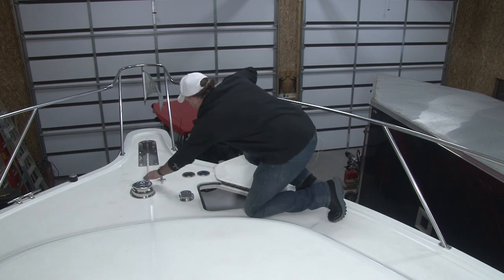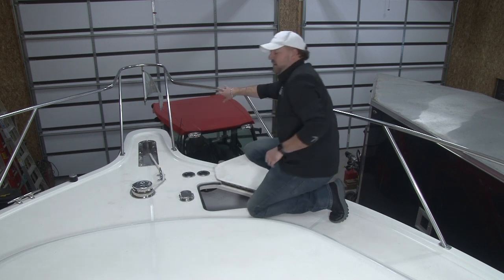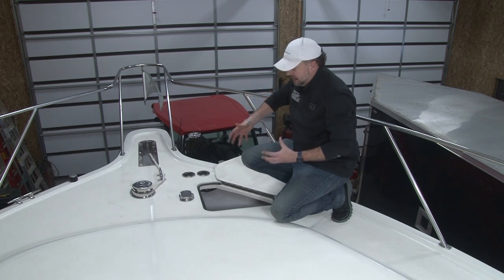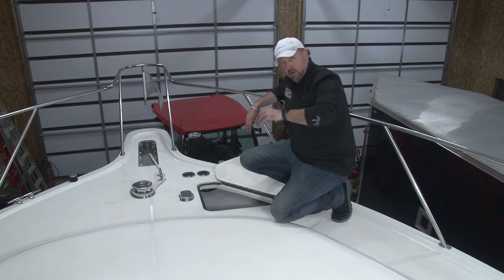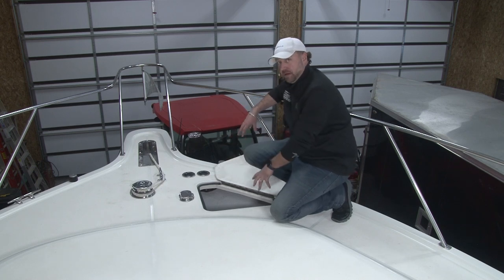You can drape it. This one is draped. It's all the way pulled out. We're in a private barn, so this particular owner has a nice option to do this here. What I recommend, if you're in a storage facility where most people are, is to take this anchor line out, remove it from the boat, run it under the boat, under the keel, and let it dry out, okay? Leave this anchor locker hatch open as well.